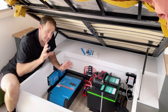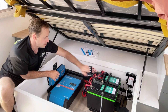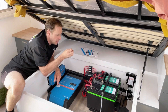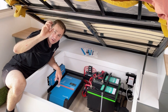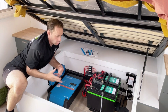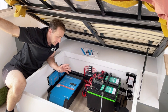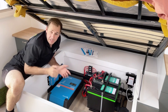There is a delay with it, and that's the other thing to note. Because this is Bluetooth and works wirelessly between this and the base, it must send packets of data - it's not a continuous stream. So whenever I turn on the microwave, there's a bit of a lag between what is shown on the screen and what the microwave is drawing. We all know microwaves pull over 100 amps at 12 volts. The lag can be anywhere from 10 to 15 seconds, I've had it as long as 30 seconds.